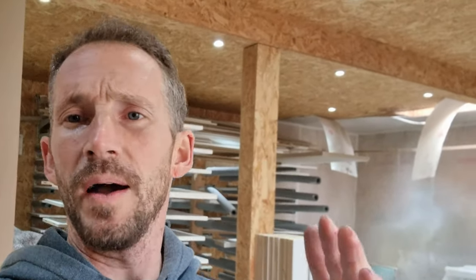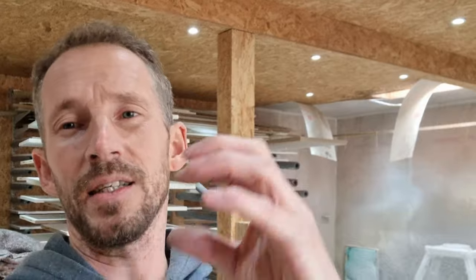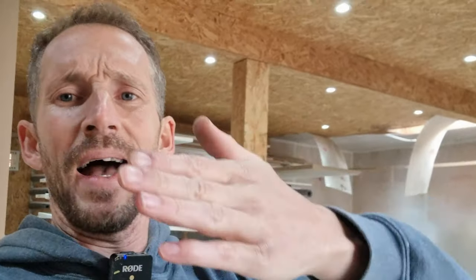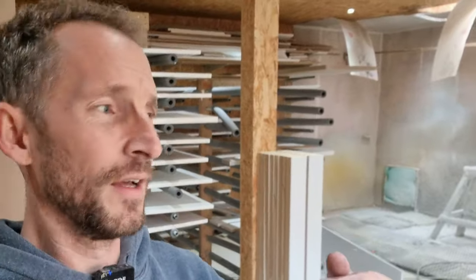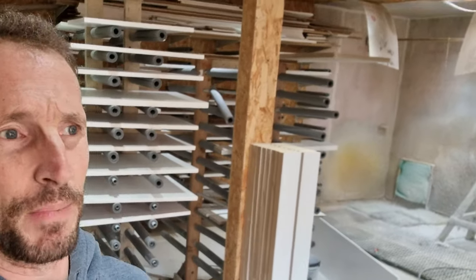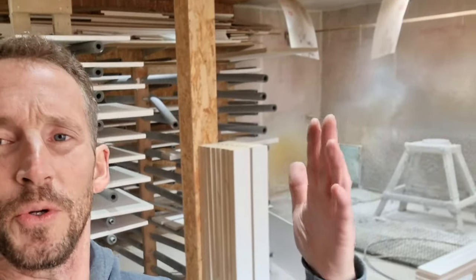So if you are happy with just sanding that back once you have primed those fluffy edges, because remember, when the primer goes into that grain, it soaks in, stiffens up the fluffy particles, turns it into something really rigid, then you sand that back and effectively it's giving you a flat surface again. So a little bit more labor, I would imagine, than the expensive stuff, but maybe a third of the price. I'm not really too sure of the expensive MDF prices, such as Finsa and the other fancy MDF, but they're not going to be cheap, especially if you are doing a large number of components.